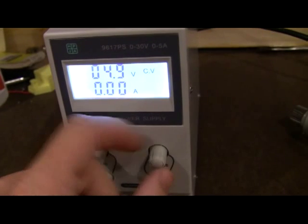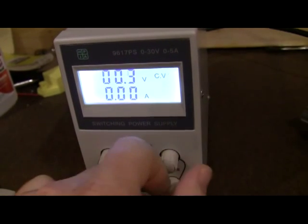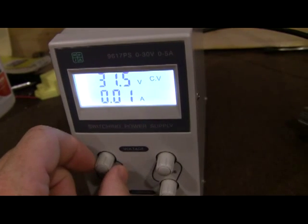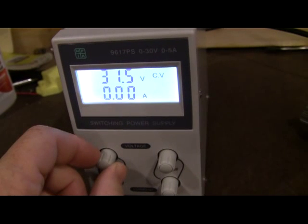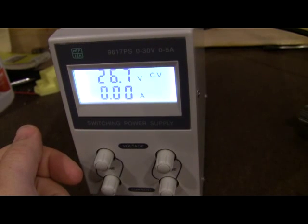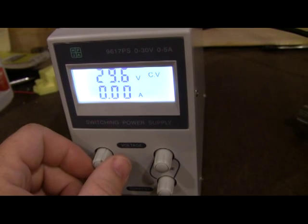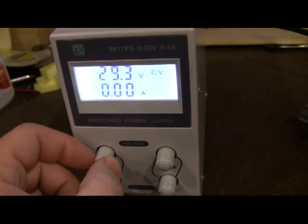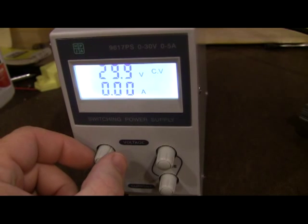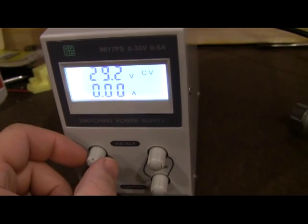The fine side covers about half a volt from one side to the other, while the coarse side goes 0 to 30. The fine side is non-linear — when it's up around 30 volts, it goes from 31.5 down to 26.7. It's a little hairy up around the high end doing that adjustment, but not terrible. It's a big pot range overall.